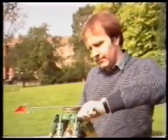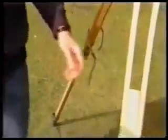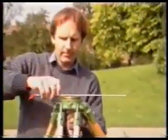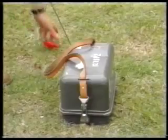Now make sure that the wing nuts on the tripod are all tight and check the screws on the adjustable legs. This entire procedure is known as rough centering. The tripod now provides a solid and stable platform for the theodolite.